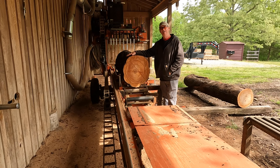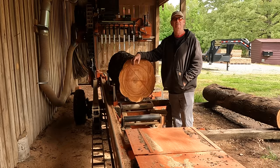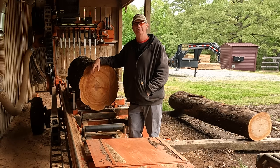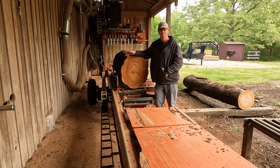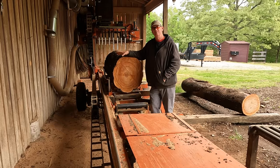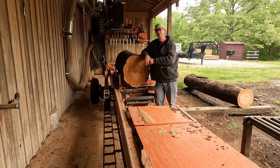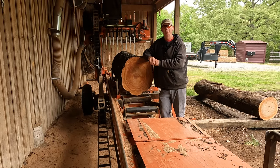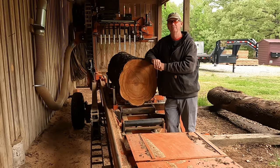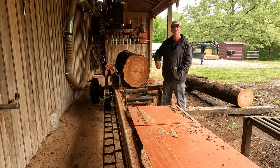Let's talk about logs. This is a cherry log. There are two species that I use a slightly different sawing technique on: cherry and walnut. The best way to describe it is you saw them like you're sawing a donut - a powdered donut you eat but aren't supposed to. The reason is there's a tremendous amount of sapwood on cherry and walnut. There's also split-prone wood in the center called juvenile wood or pith. Some species you don't notice it much, but in cherry it's very prevalent. It's useless in a board - it will always cause cracks, splits, twists, and warps. Let's look at this log and explain what I mean by sawing it up like a donut.